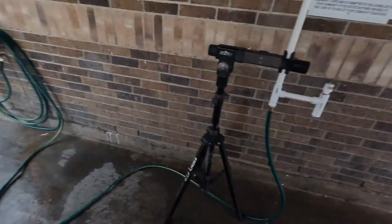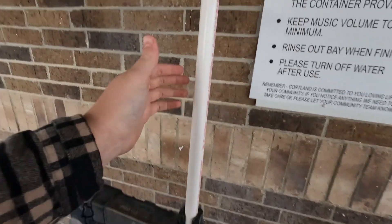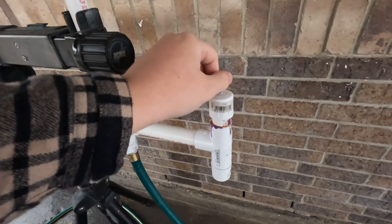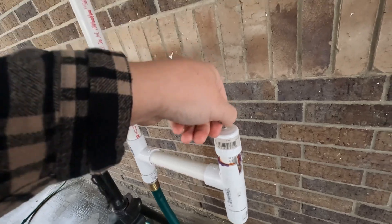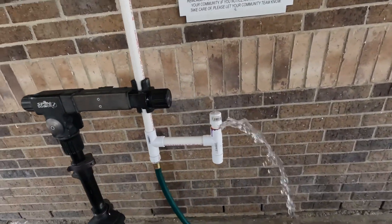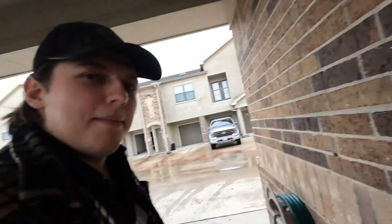We got a little bit of a leak because I had to test it out. There's a pretty simple setup. This piece would be behind the wall — this is like your main water line. Up here would be your shower. Down here, this is going to be that magnificent little pull tab, and this is going to be representing the shower diverter. This is going to represent you turning the water on for the shower, right? And what does it do? It starts pouring out of the bathtub. So you come over, you raise this piece, and then it comes out the shower.